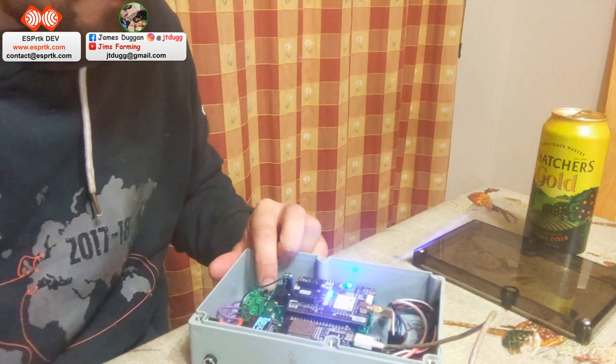And I think probably this unit here, like the switch itself, that unit there is the most expensive thing in the system. I'll have to unplug it. At about 250 quid with an antenna. ESP32 there, that is about 10 quid. There's probably less than 300 quid invested here, or thereabouts, with all the little components, a few resistors and capacitors and little buzzers and switches. So yeah, RTK base station for 300 quid basically. No ongoing subscriptions or anything like that, which is pretty good.